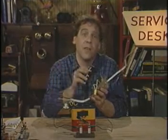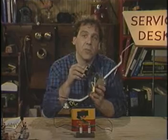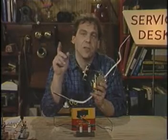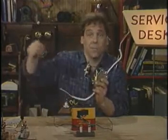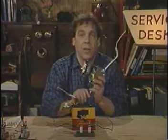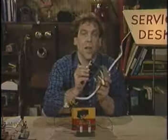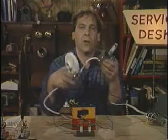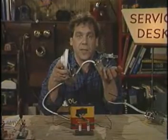Because of the hot/earth situation, a light switch has to be in the hot wire. That makes sense — why not switch the dangerous wire off? But there's a better reason: if the switch was in the supposedly neutral white wire, the circuit would work as intended, but when the light was off, a portion of the white wiring would be hot through a circuit via the light bulb. If the power comes to the light first and then goes on to the switch, both wires to the switch are hot and the white one should have a warning black flag on both ends.